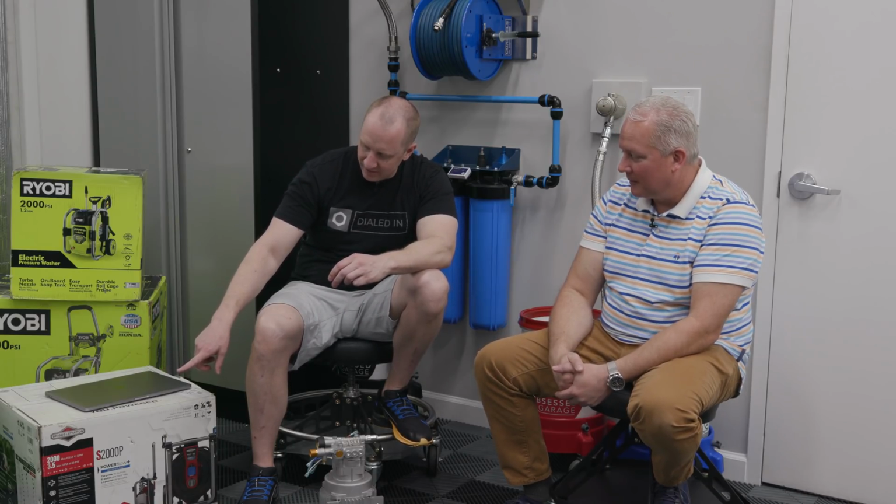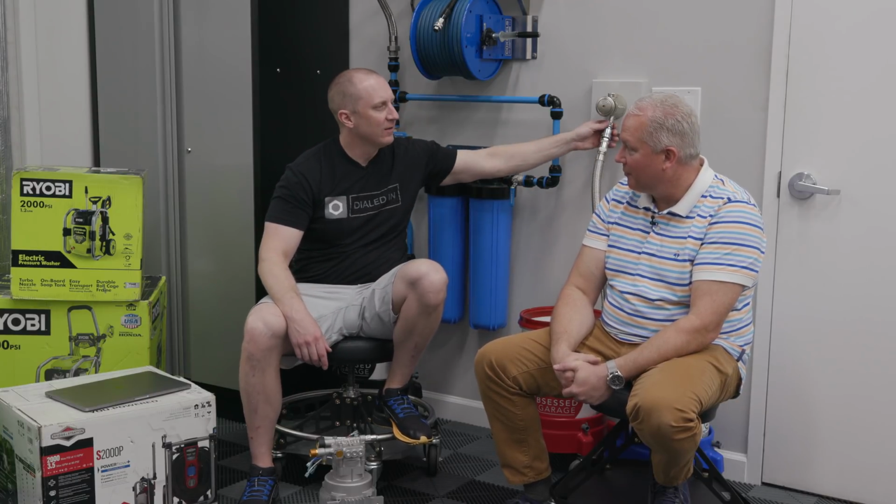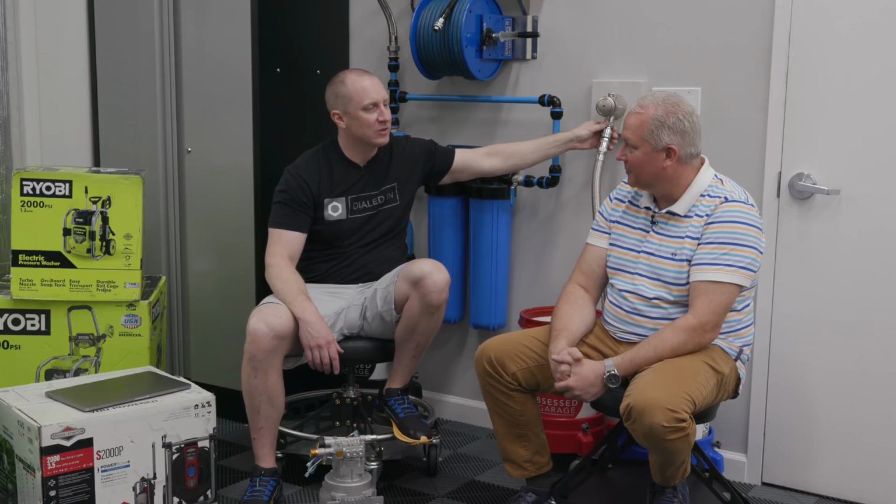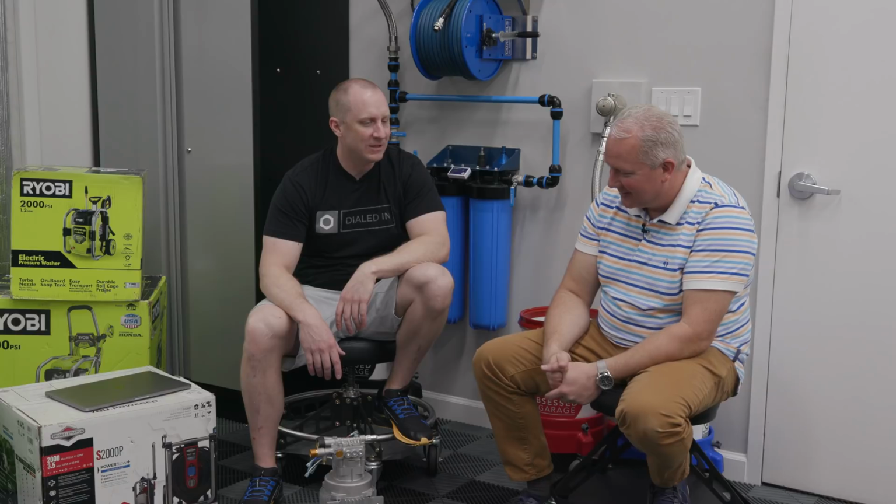It's saying that it's 3.5 gallons a minute at 80 psi. Well, 80 psi is what comes out of the spigot, right? 60, 70, 80, maybe 100 if you had some high pressure coming out of the spigot. So they're just basically opening up the front of the pump head and letting it flow, and maybe that's how you get 3.5 gallons a minute. Because I've never tested a 3.5 gallon per minute machine. Shoot, my $4,000 Krenzel 23 amp machine got like 3.3 gallons per minute.